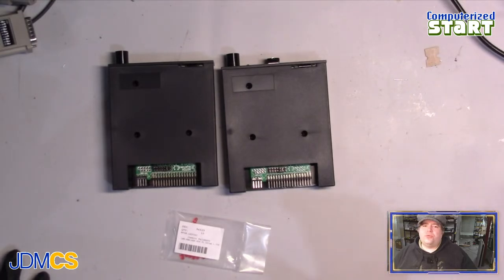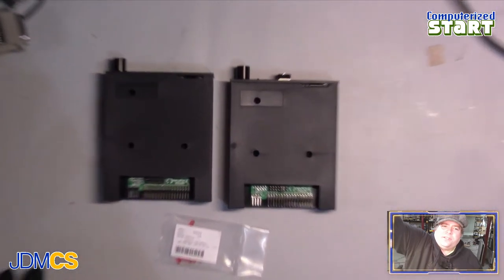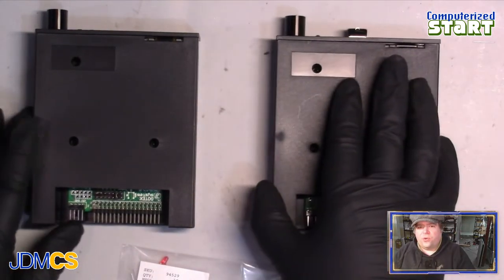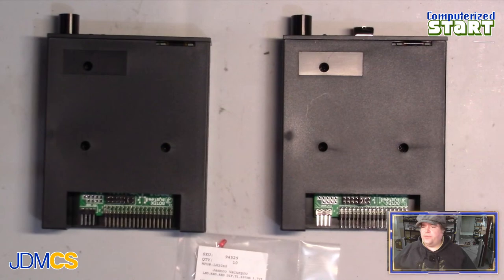However, due to parts shortages, those have not really been available since about 2021. So Gotek redesigned their board to use a different microcontroller, and that would be initially the Artery AT32F415. So unfortunately, the disadvantage of that microcontroller is it only had 32K of SRAM. And apparently that little amount of SRAM causes problems with two disk formats in particular.